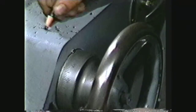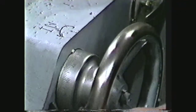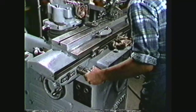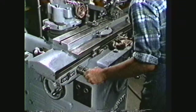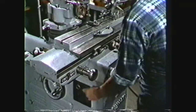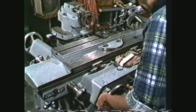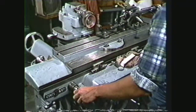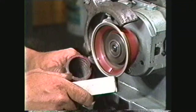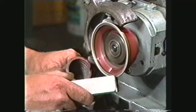It is a good idea to mark the infeed rotation with a grease pencil next to the cross slide wheel. Always dress the wheel from the outside to the inside. A feed of two thousandths is used for dressing the wheel. Stop the spindle. If the grease mark is gone, make a finish pass of one half to one thousandth and then make a pass with no infeed. Use a dressing stick to scrub the wheel to remove bond around the Borazon grit.